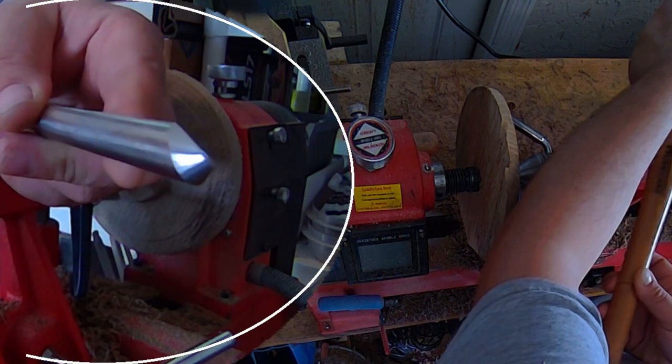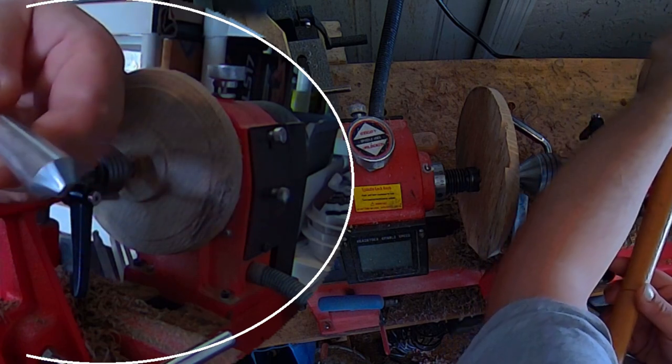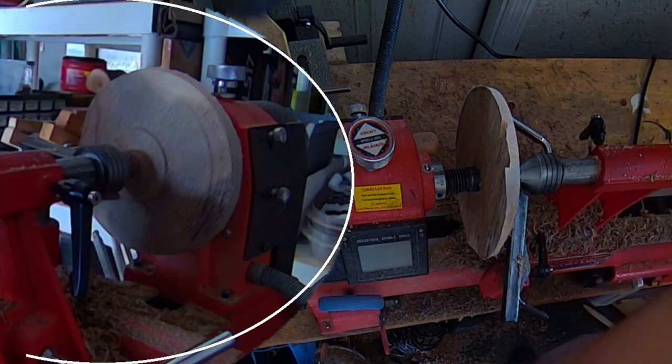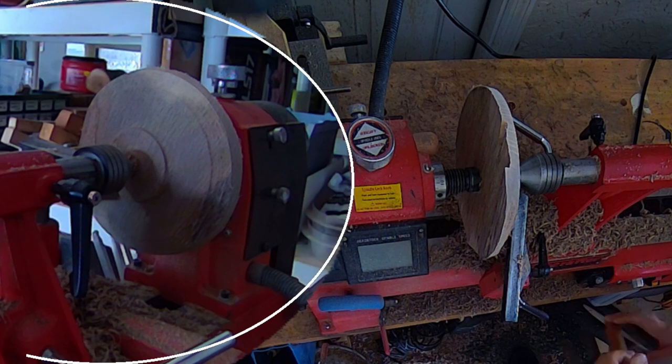Okay. I have an 80 grit CBN wheel to shape and then a 350 grit to get a nice fine edge on there. Doesn't really need to be that fine, really a 180 or 240 grit would be fine. But anyways, this one is what I chose when I did, and I'm not disappointed by any means. Anyways, I'll do a shop tour eventually. Let's get a mask and face shield on here.